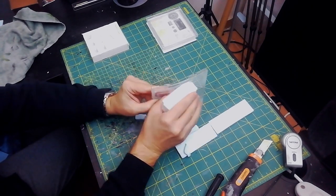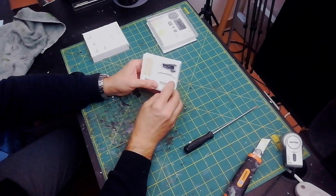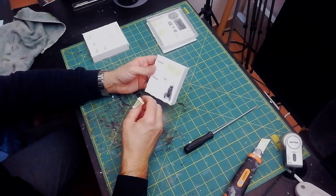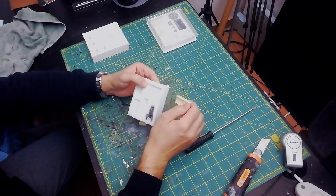For the detachment of the molds, once hardened, remember, trust the silicone. If you have done all the upstream steps well, there is no reason to fear, and you can extract your pieces with a certain safety margin without fear of damaging the mold. Pay particular attention to the pieces that, by their nature, were not entirely resting on the base.